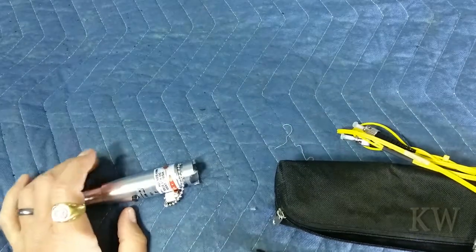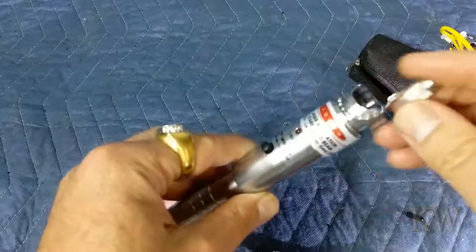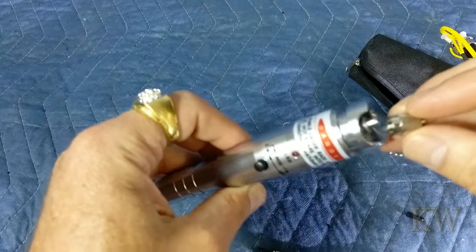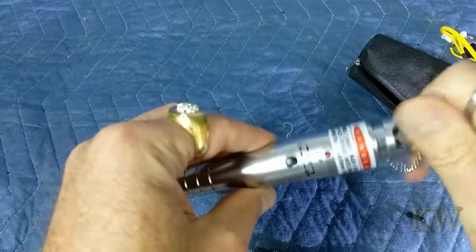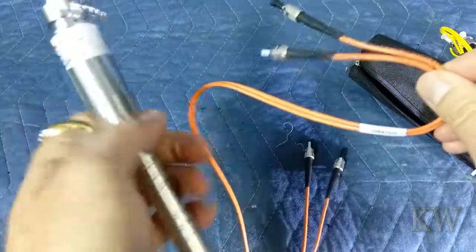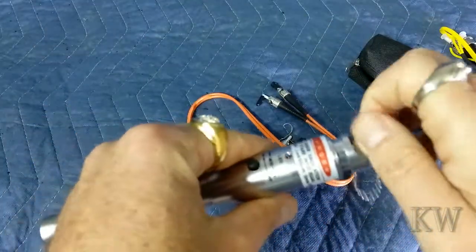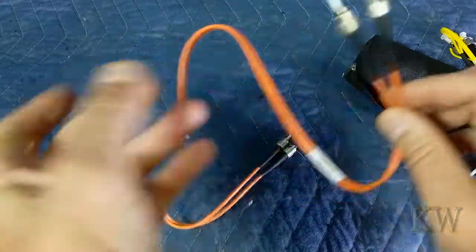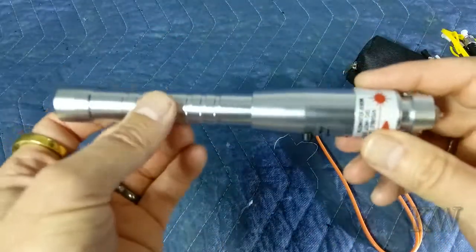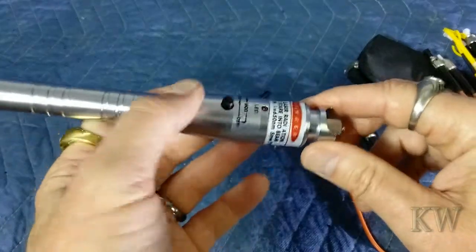Like I said, it's not a tell-all but it's a good first step for testing fiber, especially if you suspect something's dirty. Most fiber usually doesn't go bad. Sometimes you get a jumper or a strand with a kink, or you'll find a jumper that's bad and replacing it fixes it, but a lot of times it's just dirty. So you end up doing a lot of cleaning with fiber.